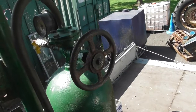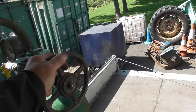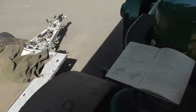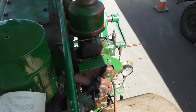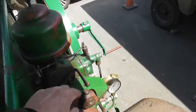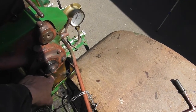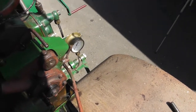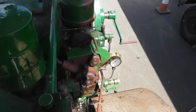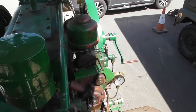Once you've replaced the fuse holder in the cylinder head, get onto the stand and open the air valve. Once you've opened the air valve, when the engine has turned over approximately half a dozen times, as quick as possible, drop the pump handle down and move back the starter valve lever out of the way, and then turn her on to full compression. And if necessary, you need then to back off the throttle. And there you have it, simple as that.